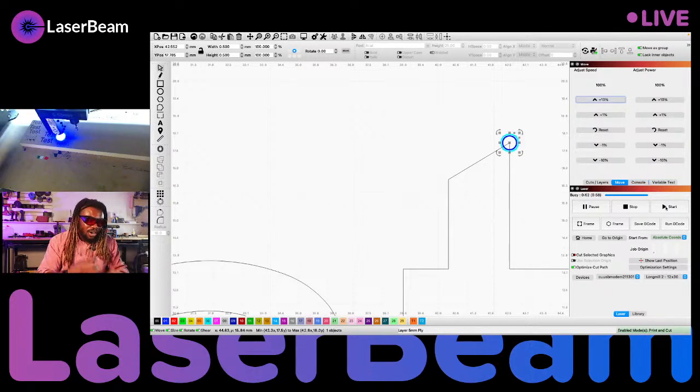We reset our coordinates to 0 manually in the console. We clicked on user origin. We reset our user origin to the same point. We selected our start from user origin. We started the project. It engraved the first test. After that, we moved our material.